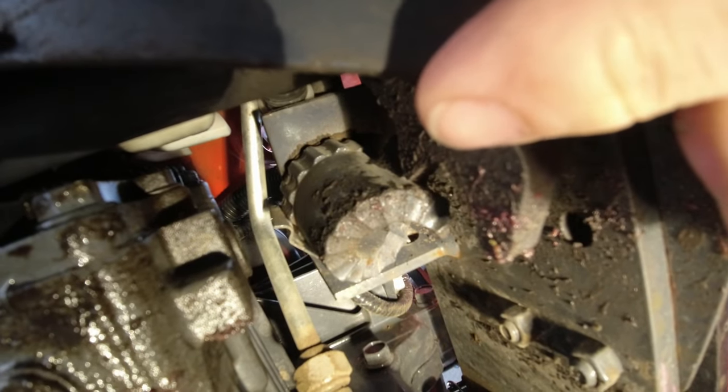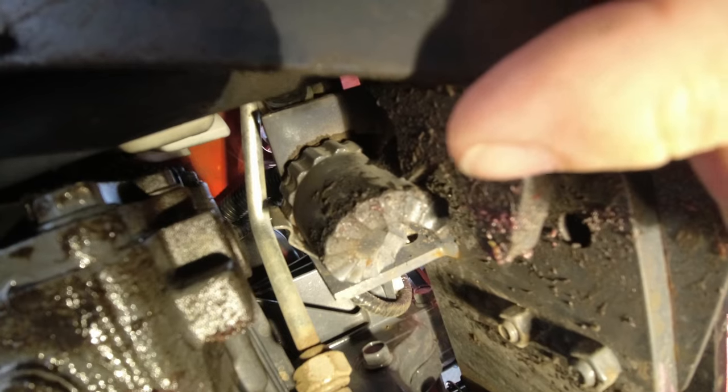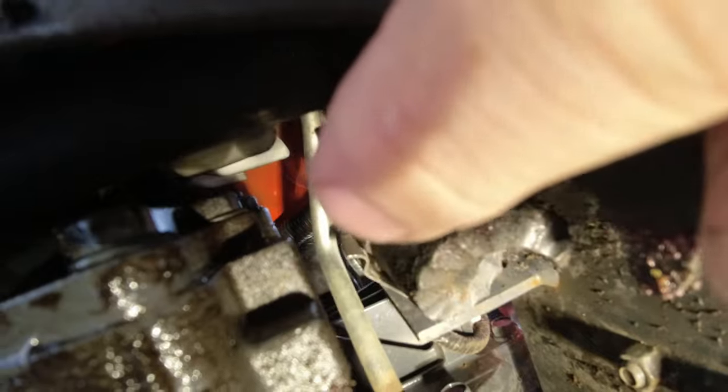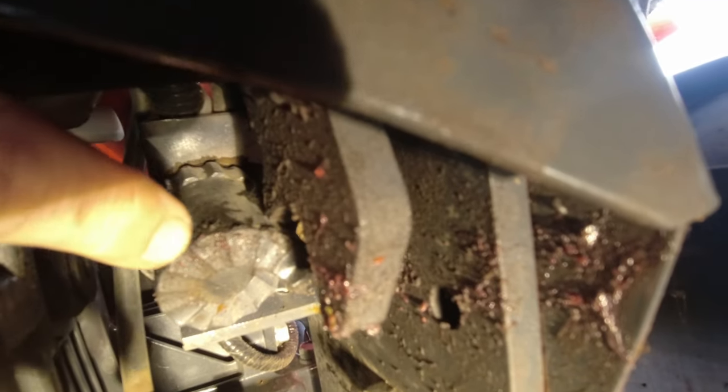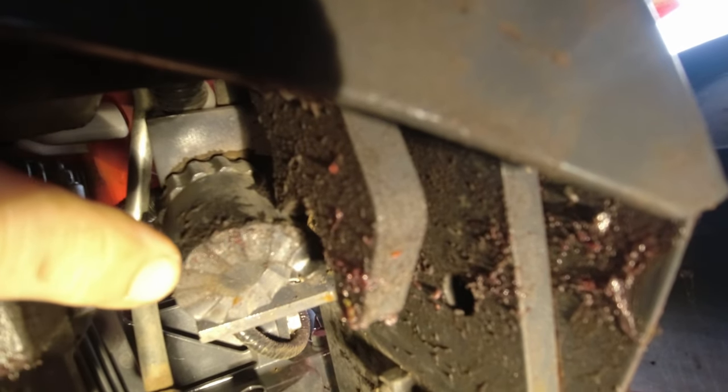Under the tractor — this is the exact reason why your knob won't turn: if your rear PTO is not in the top position. That knob can rotate in both directions. You can see there's a metal flange and a bunch of grooves up there — that's what's allowing it to notch when you turn it left or right. What changes are the teeth right here, and those teeth ride in a channel right here.